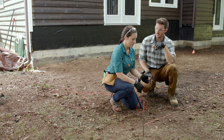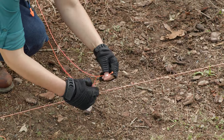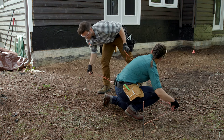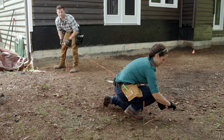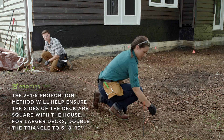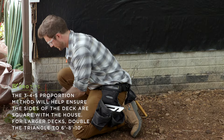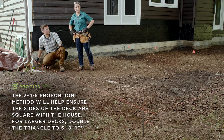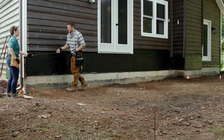Once this is tied up, we're going to be using something called the 3-4-5 method. Since our deck is longer than five feet, we can double those numbers and go 6-8-10, which will make our measurement more accurate. The front string is about a foot beyond the actual deck perimeter — it's used so we can tie a string to the side of our deck and square it with the house. We can slide the string back and forth to get it square.